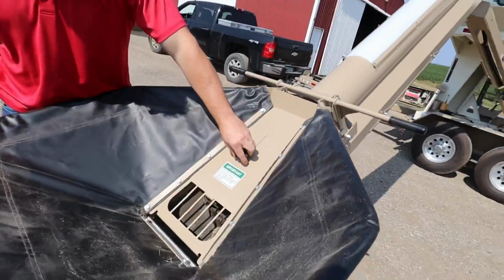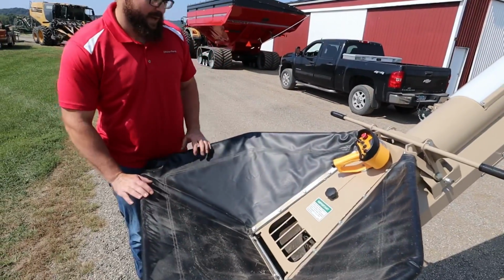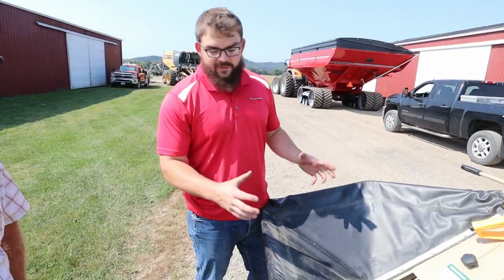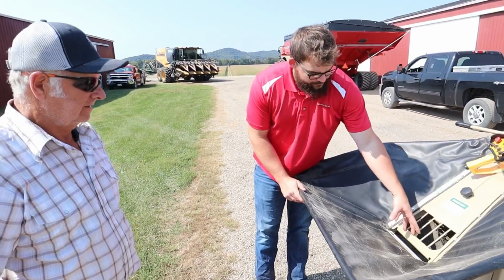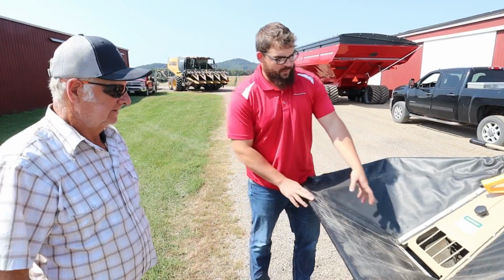This is a baffle. For certain crops, like what we recommend to guys, say I'm filling an individual box planter, to ensure we're not getting too much capacity there where it's going to overtake you and you're going to end up overflowing, you can restrict the seed intake by dropping this baffle down. Okay, I see. If you're filling a drill or centrifugal unit, you'd run that wide open.